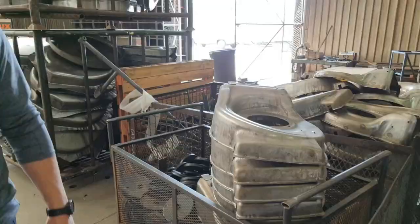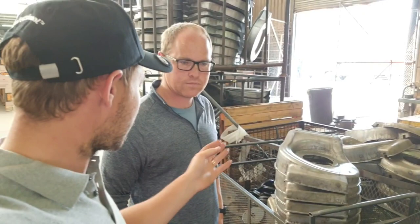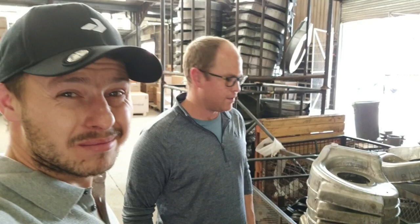That's quite a test. Okay, Bruce, just quickly explain to us why it is so important to have a thicker steel in your high vac mower. It's basically for impact with stones and whatever else might be lying around on the ground. The industry standard is about 1.6 mm, and we use a 2 mm steel. It basically doubles in strength for every 0.2 mm, so having 2 mm makes a massive difference. It's about three times as strong as the industry standard. It just lasts a lot longer, a little bit heavier, better quality cut, much longer lifespan.